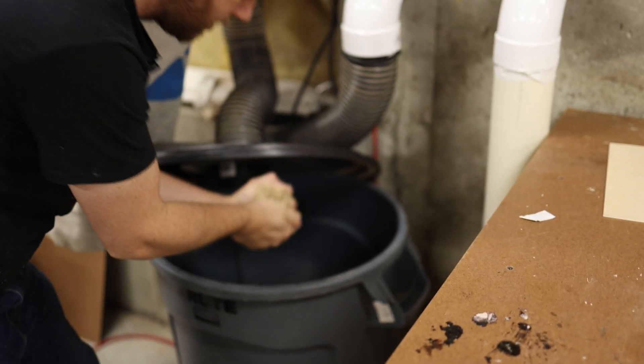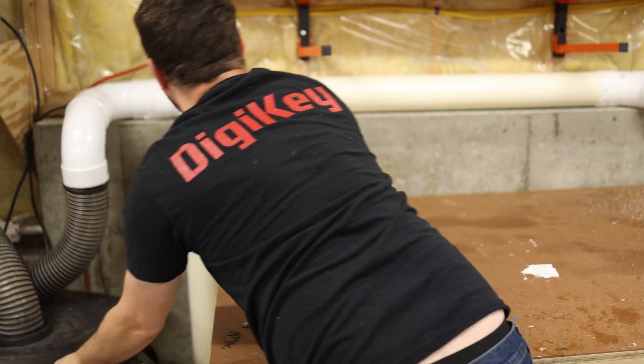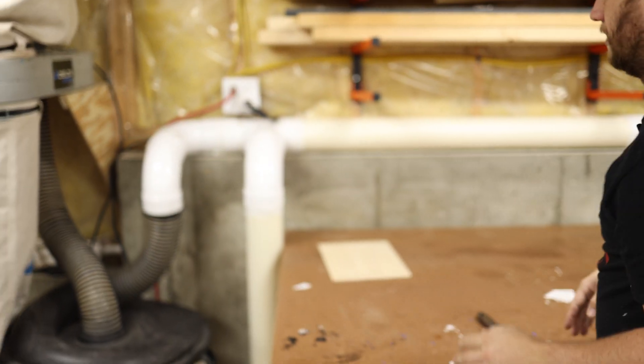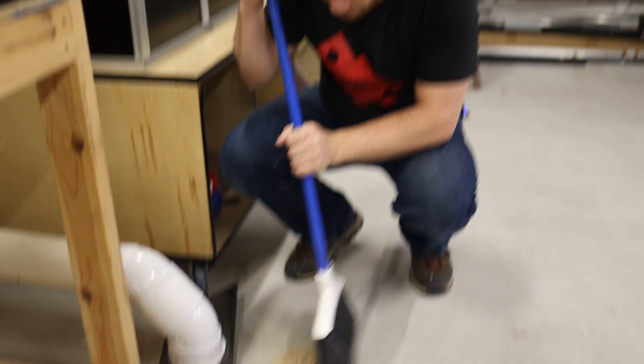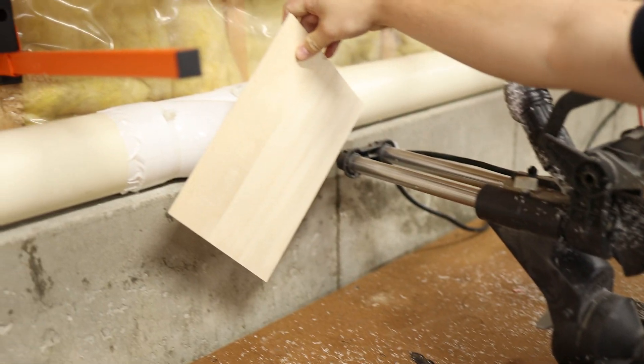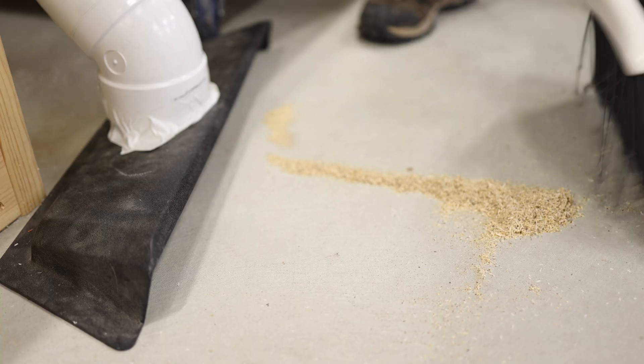To test this out it'd be interesting to put a little sawdust in the floor sweep but leave the other three ports open. I know this is really scientific — if I wanted to be more precise I would get an anemometer and measure the cubic feet per minute, the CFM, before and after this test — but I don't have one so we're doing the dustometer test. With all ports open I can feel with my hand there's really not much suction. To mimic what the blast gates will do, I'm going to use a small piece of plywood to cover up the other three ports. Did you see how well that worked? It started sucking up the dust from way out here — I could even hear it making its way to the dust collector. This confirms that the idea is going to work. All I need to do now is design and build the actual blast gates.